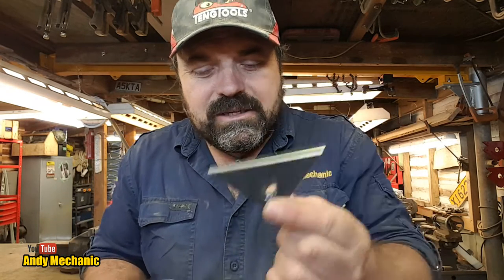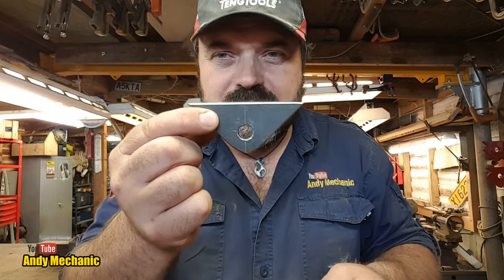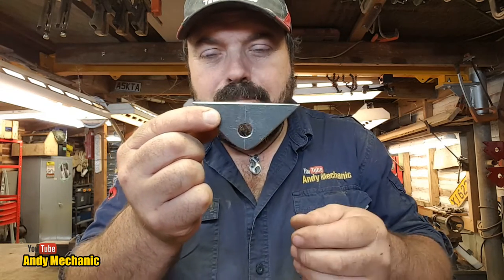Because this is a wooden building, don't forget, I can't make every beam exactly the same. There are discrepancies, so it takes a hell of a lot of measuring and setting up. But first thing we need to do on these beams, you'll see if you look at that one there, there's a little eyelet that hangs down. These are great because I weld them onto the beams as I'm making them, and it means that I can hang things from the beams, I can pull on the beams, I can do all sorts. It gives me a really easy mounting point.